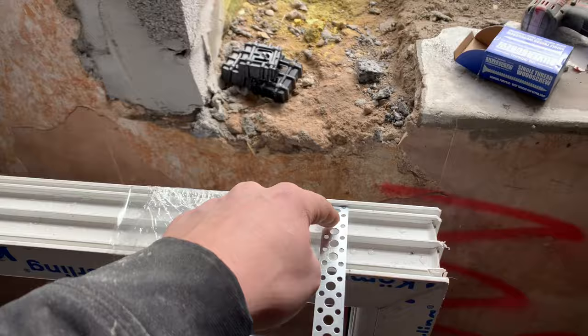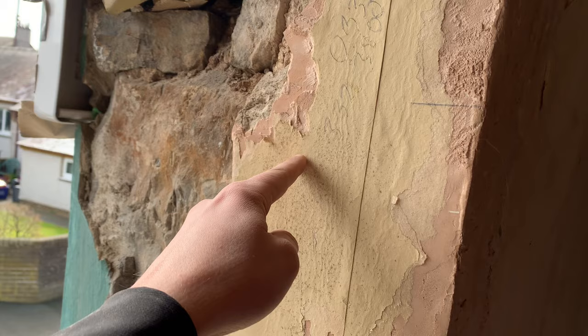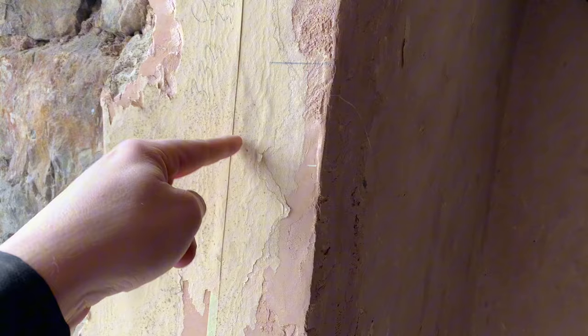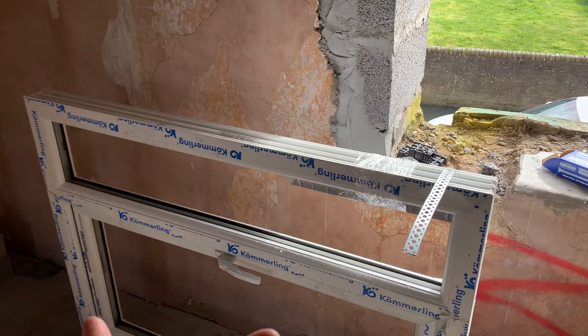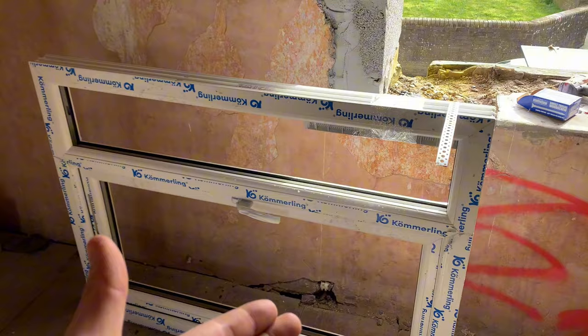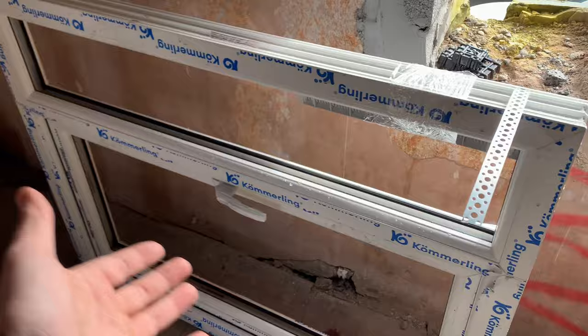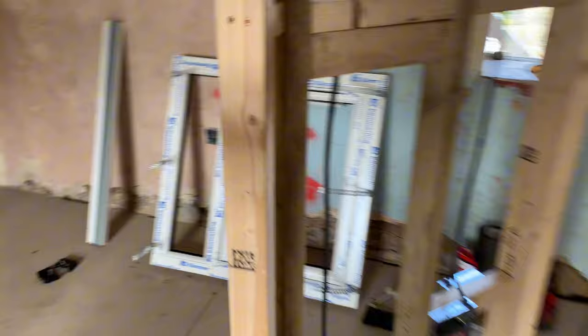Installing this, you just screw it in - you do three on each side and it gives you a bit of play. So we'll have the strip going in and we can do as many drill holes as we need to catch that rock and secure it. I had a thought - when I was taking out the other window breaking the raw plugs, I thought oh my god when it comes to next removing that window, they're going to have a real pain getting it out. They'd figure it out with opening the window, seeing there's no screws attached, and then they'd realize it's tied in with this wire bar. Just going to show you one that's fitted - I'm going around prepping all these and these will be tied in.